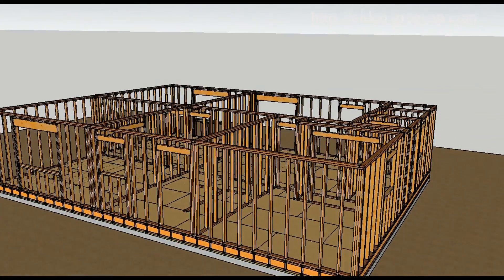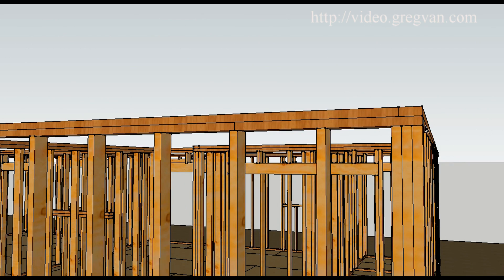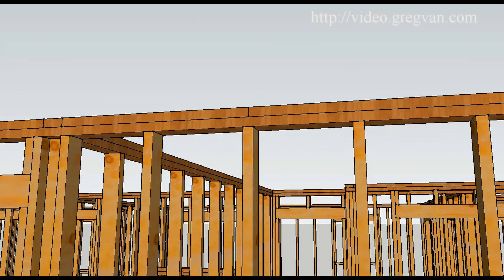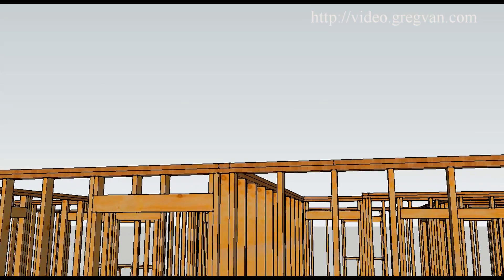Here are a few examples. This one will require a strap — you have a plate that's less than four feet long, so that's a given. The next one on our list is questionable but will not require a strap if the bottom plate continues over, because you can see it's not even close to four feet. The break goes away, so this bottom plate can act as a strong structural tie without these breaks affecting anything.